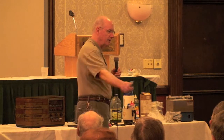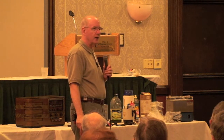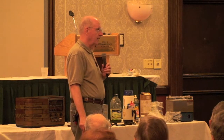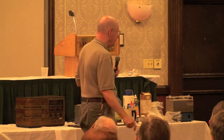you zap it on there, and you've got this clean cloth, and you start going around, and it comes up with this yellowish brown covering on that. That's dissolving out the Bakelite. If you leave it on there long enough, it'll look like it's been sandblasted. So if you don't remember anything else about tonight, remember, don't put caustic solutions on the Bakelite.